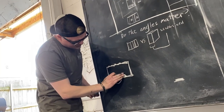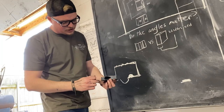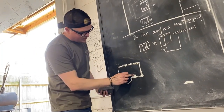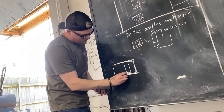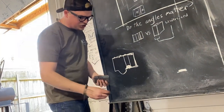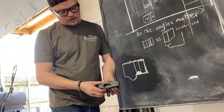And so what that'll do is help draw this blade out, and it creates a nice separation between the eye and the blade. So we're gonna set a 1 inch fuller this way, and then we're also gonna set a 1 inch fuller that way. And it's just like the design of a sports car. The idea is we want a nice transition here